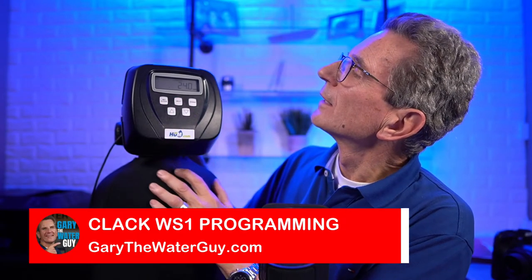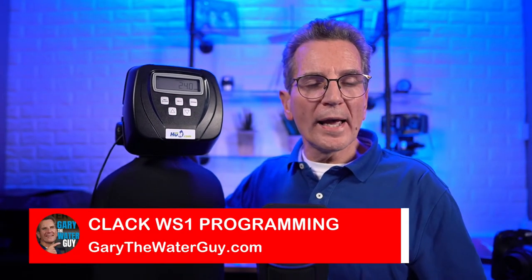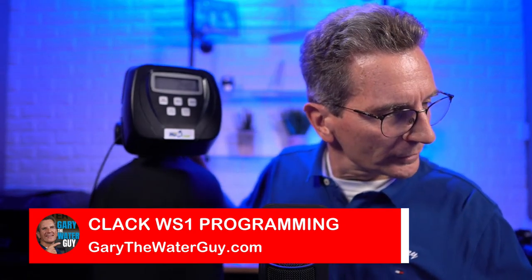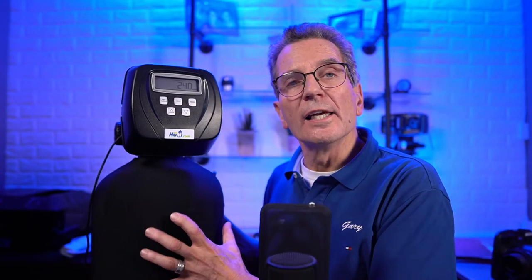So we go next. And so capacity, yeah, we can leave this at 24,000, but we're going to get into some arithmetic here pretty soon. So capacity, again, would be 0.8. If each tank is 30,000 grains, if you've got a twin 30,000 grains, you would again set this for 24,000.